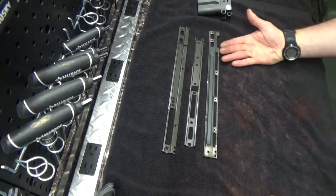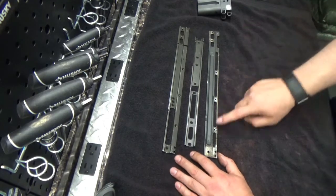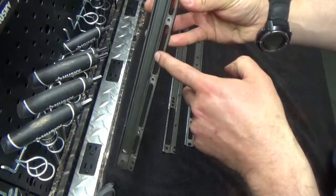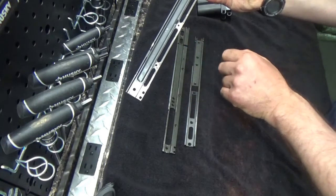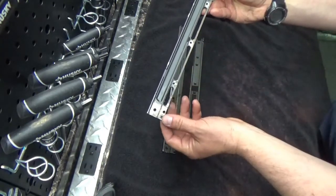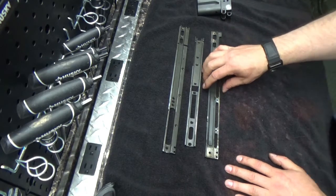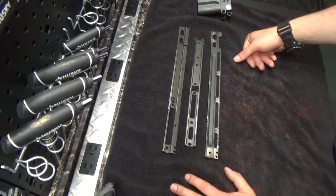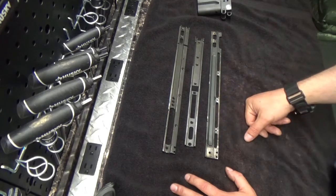While we're talking about Rock Island rails and Saco Defense rails, the only difference is in the left rail here. You can see this is skeletonized, and by skeletonized I mean these slots here are milled out, and when this is actually on a gun, the channel covers this, but there's two holes in the channel for your ammo hanger, and on a Rock Island those holes are covered up because these slots aren't milled in. So that's the difference on the Saco Defense gun. You can see on the front of these, again, I don't have the necessary parts to build all this. I just have a set of rails and a trunnion here. But first and foremost, we'll cue in some pictures of some Rock Island Armory rails so I can show you what I'm talking about as far as the difference goes.